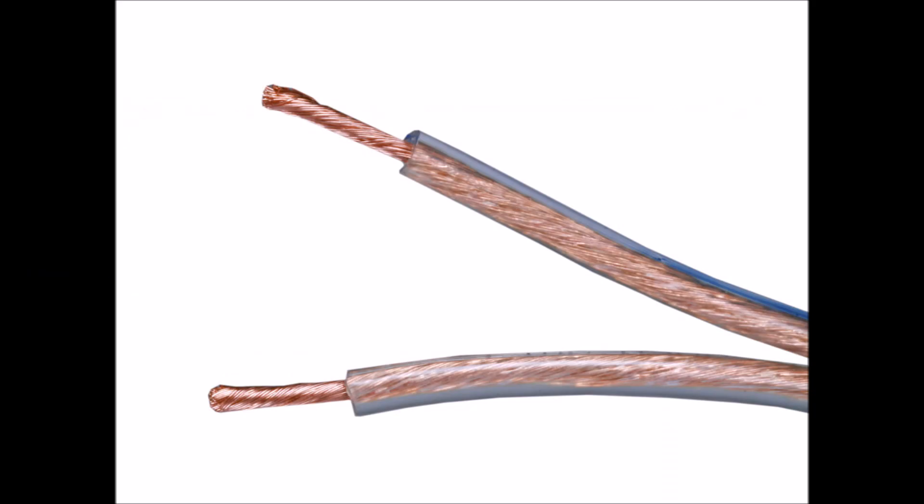When you're indoors, you can really use almost any kind of wire you want. Again, the thicker the better to a point, but the thicker cables are going to be more expensive because there's more copper in it. In this picture, this is speaker wire, which works just fine for 12 volt DC purposes, or 24 volt, or whatever you've got.